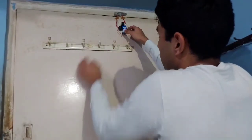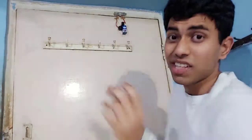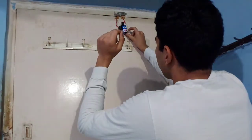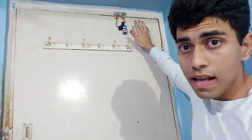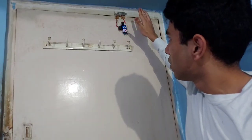Let's see how this works. I'm going to connect the battery — when I connect it, the buzzer shouldn't ring. It should just give a little tick because that's the time it takes the relay to process one switch. There you go — that was just one click. Now the circuit is closed and current is passing, and the buzzer isn't ringing.